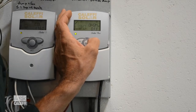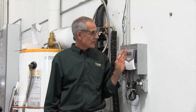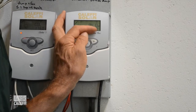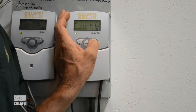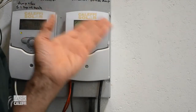Then you're going to come to one you haven't seen before, because it only appears in Arrangement 3 — it's called AHO, which stands for After Heat On. I call it backup heat; some people call it after heat. That's the on temperature of your backup heat source. So if it's a boiler and you don't want your tank to go cold with no solar, the factory default is 110 degrees. At 110 degrees upper tank temperature, measured with sensor 3, it's going to turn on your backup heat source and heat up to AHF — After Heat Off — which is factory set at 120 degrees.